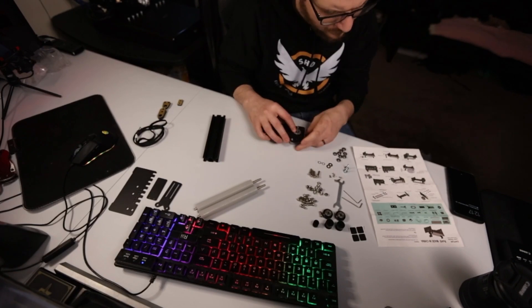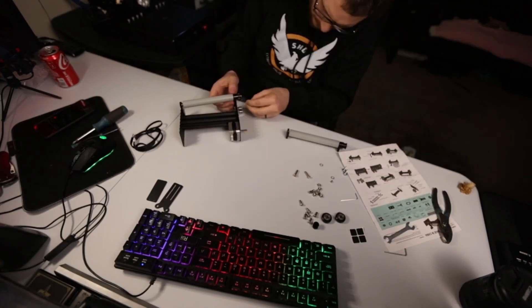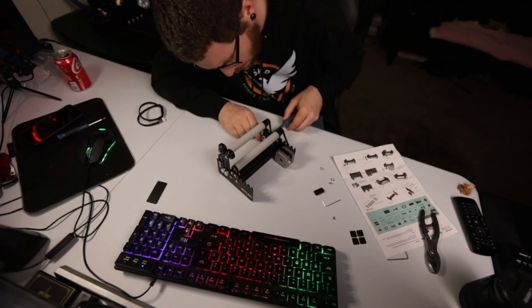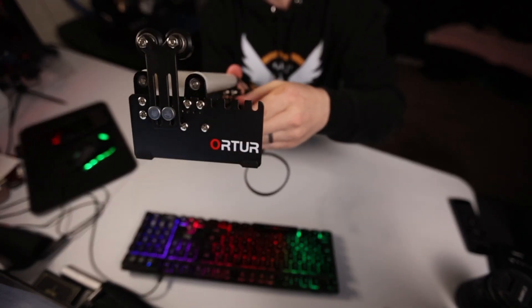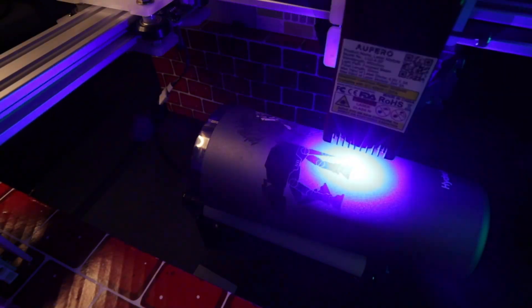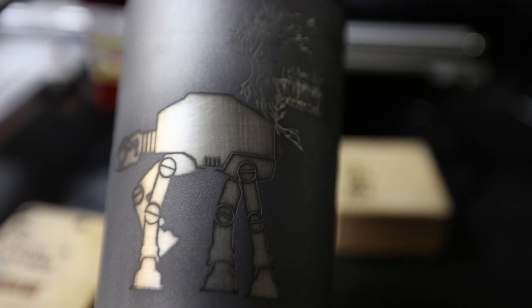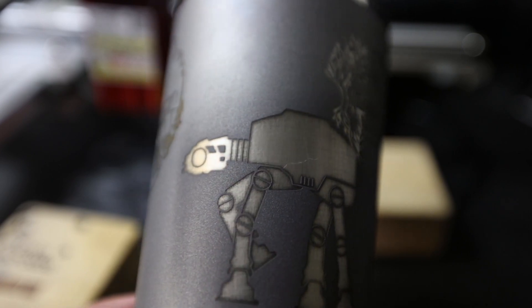Unlike the AL-1, the YRR 2.0 comes in a thousand tiny pieces and has to be put together from scratch. It took me about 30 minutes to complete and I was only mildly frustrated by the time I had it conquered. The materials it's made from are all high quality — decent screws, a real metal frame, with only a couple of laser-cut acrylic spacers. My main complaints originate with the overall design: to change the spacing of the rollers or guide wheels you have to loosen multiple nuts in multiple places multiple times, which is annoying. After a little trial and error, we were able to get decent results with the rotary on a powder-coated tumbler. This isn't going to replace a CO2 laser for heavy tumbler work, but if a diode is all you can afford right now, it gets a pass.